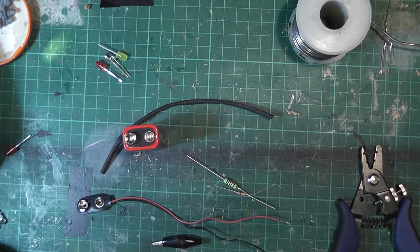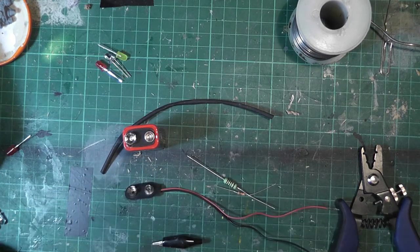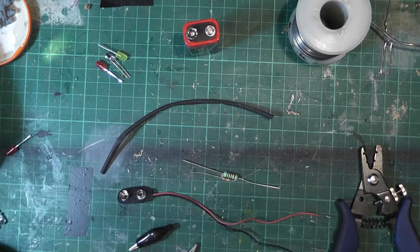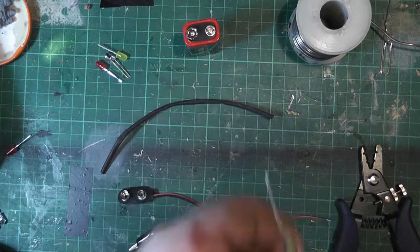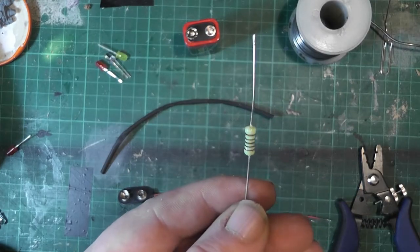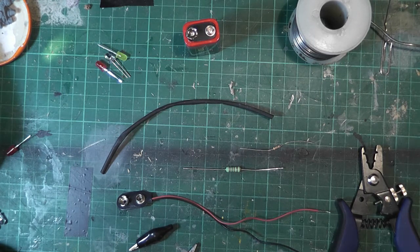On this episode I'm going to show you how to make a quick LED tester — very very basic, very very easy, but it's one of those tools that might come in useful, especially if you're doing a lot of LEDs and want to make sure they work. This is what we're going to use: a nine volt battery connector, a nine volt battery, some crocodile clips — a black and a red so I know which is positive and negative — and a 1k resistor. I've got two kinds: a quarter watt resistor and a one watt resistor.